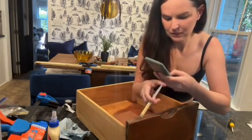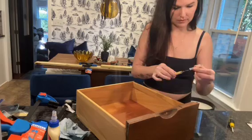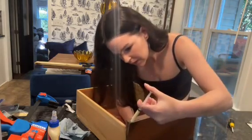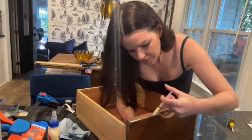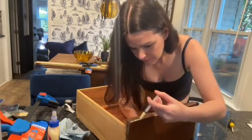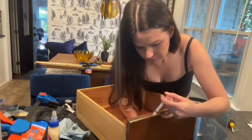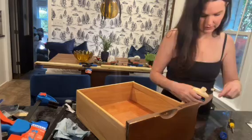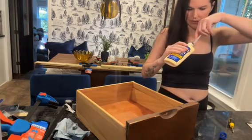I'm trying to film the best angles for you — my video skills could be improved, but I'm doing this on my own and just winging it, so hopefully you like it. If you caught that, I removed the syringe tip and I'm going in with a heavier application of glue at the top because the veneer was separating so thickly and I needed to just get more product in there.